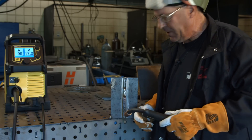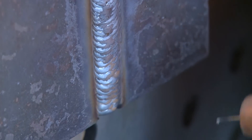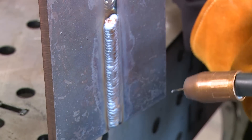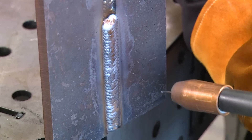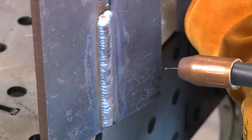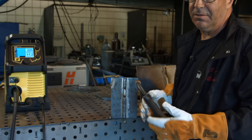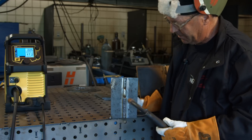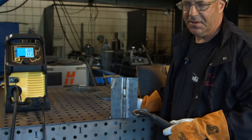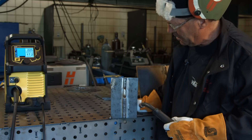First thing I'm noticing — I felt like I was carrying a little too much metal. I may have done better to hold my pause longer on the fill pass. It wasn't bad. We've got a little bit of a dark color which I don't like, so there are a couple of things I may change. But I'm looking for arc features and how the weld pool reacted — I like this. I'm thinking I could make some fairly heavy repairs or fabricate some fairly heavy stuff if this is all I had, running .030 wire on 110 volts. Normally on .030 wire you're probably doing quarter-inch, 3/16, or 1/8-inch material. I'm going to buff the glass off and we'll get some shots of the finished weld.